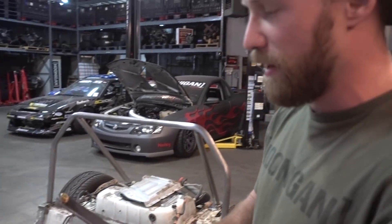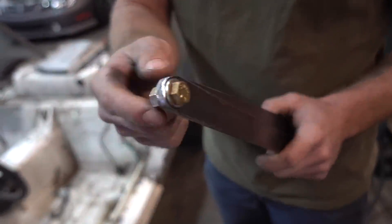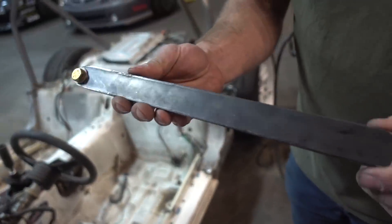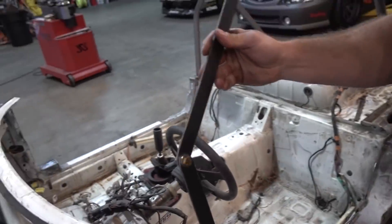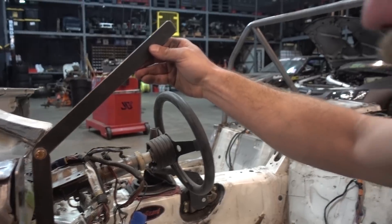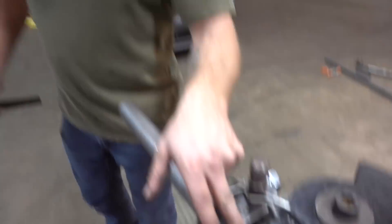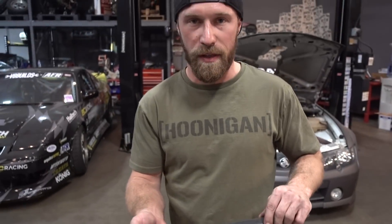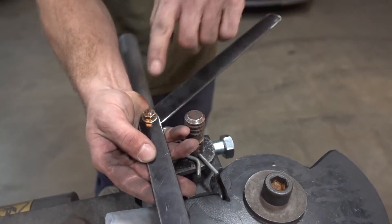So there's my bend line for the first bend. I made this really quickly just to show you that you can make an angle finder out of anything. Rob has a bunch of fancy stuff here that's really cool, but this is just one-inch strap. What I did was drill a hole through it at the end, put a little bolt, cut them to one foot, both of them, and bolted them together. So what this does is I can kind of squeeze it tight and find the angle of what I think would look cool, and use that as a reference for the first bend. I have my mark here to start my bend and my angle finder that I just made. Basically I'm going to put that at the pivot point and kind of make it match.